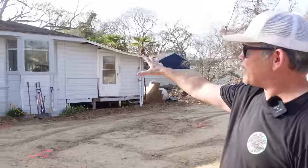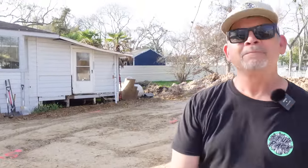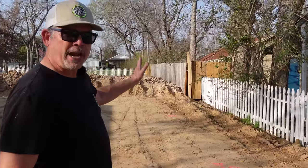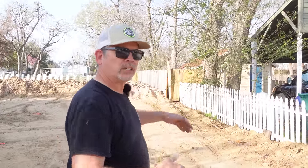Back to the picket fence — if we simply pull a measurement from here and the back, our building won't be where it's supposed to be because the fence runs at an angle the whole length. We can't measure from the street because the street isn't at a 90-degree angle to this property line, and we can't measure off the house either. So to make our building parallel with the property line, we'll take the two straight end posts of the picket fence, come off each one a foot with a stake, pull a dry line all the way across — that'll be one foot off the property line — then measure five feet to our building line.